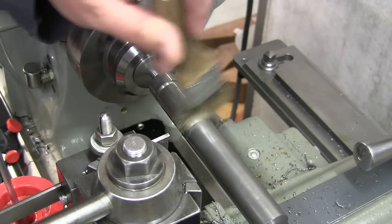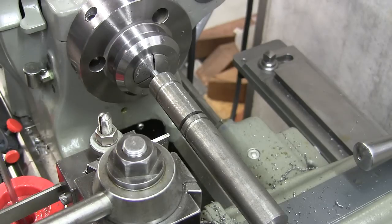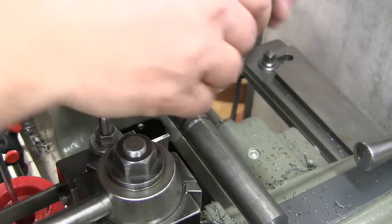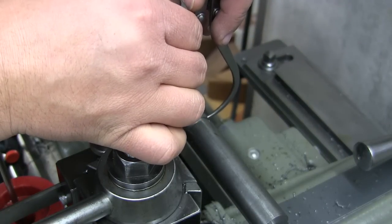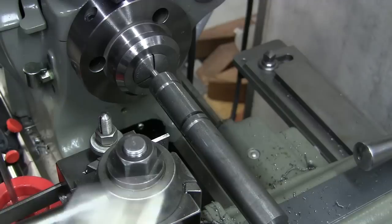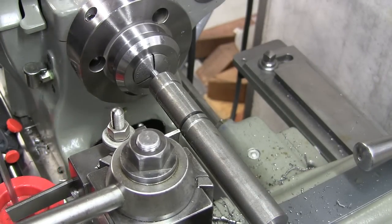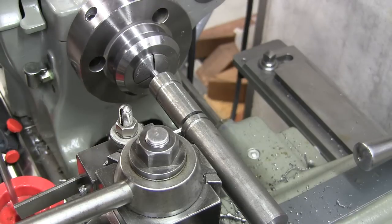I just lost count spinning this thing around. The dial goes to 250, and yeah, I lost count. So what we got to do is use our old school calipers here. Okay. 522. 114 thou. I am going to feed in 100, all right, and then I'll fine-tune the 14.